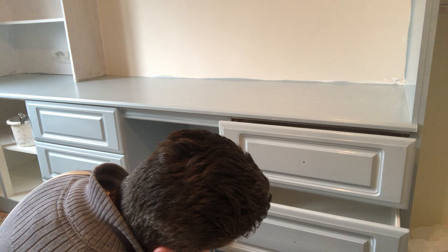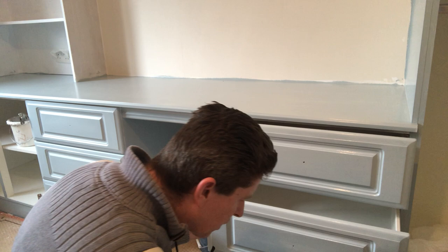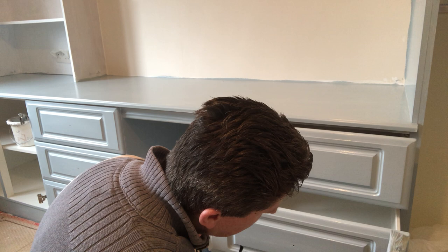There's your four edges. See the more paint you put on, the easier it goes on, honestly. But in between coats, sand it down — every coat you give, give it a wee light sand down with fairly thin sandpaper.